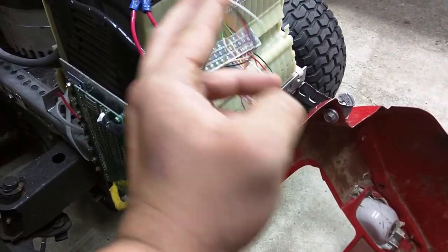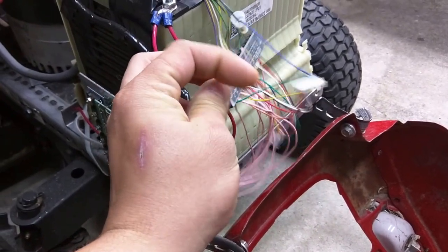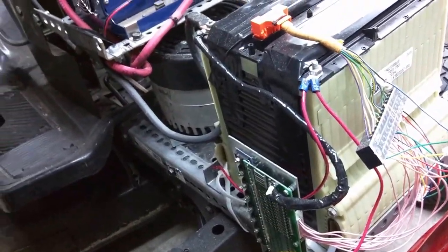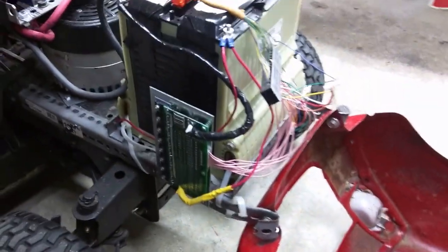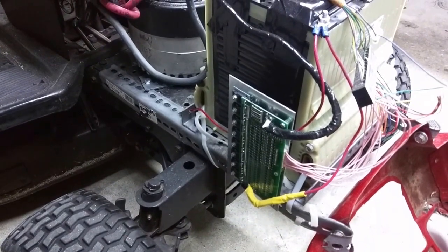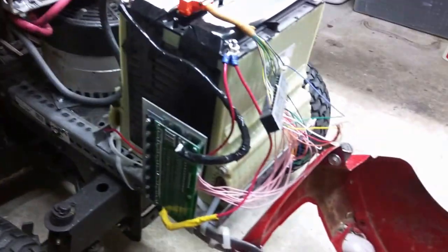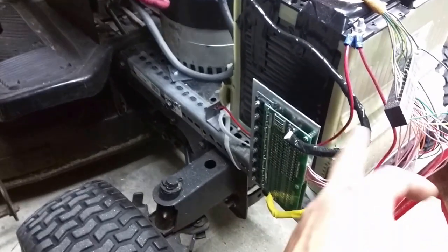And with this, I can actually check the balance leads, and I can actually balance charge it, but I can only do half the packs at a time, simply because a 12S charger costs way too much. Right on the side here is a BMS, or a battery management system, that I decided to go with. It's a 150 amp battery management system, and turns out you cannot actually run this thing through that at the moment. However, that's okay. The lithium power seems to stay pretty balanced. I only use it for charging at the moment.